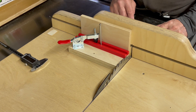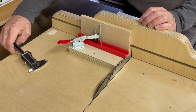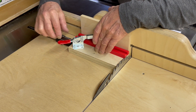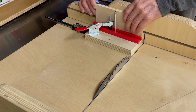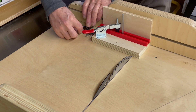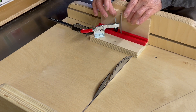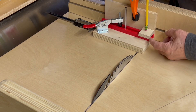I want my overall width of the bar to be 154.58 millimeters. Therefore it's a 47.42 millimeter difference, and divided by two is 23.71 millimeters per side. So I'm going to use a piece of double-stick tape and stick my caliper down, zeroed out, and press it onto my base. Now I'm all set up — I'll pull this back, move the whole assembly over by 23.71 millimeters. I'm exactly right there. Lock that down carefully, gently move back to contact it, make sure I'm square — yep. So now I'm just going to clamp this and cut at that point. I like to use a little block right where the saw is going to cut so that this little piece isn't going to go flying off.